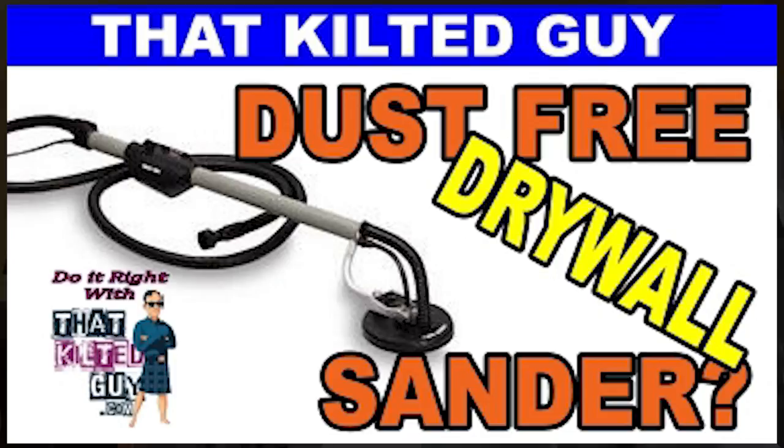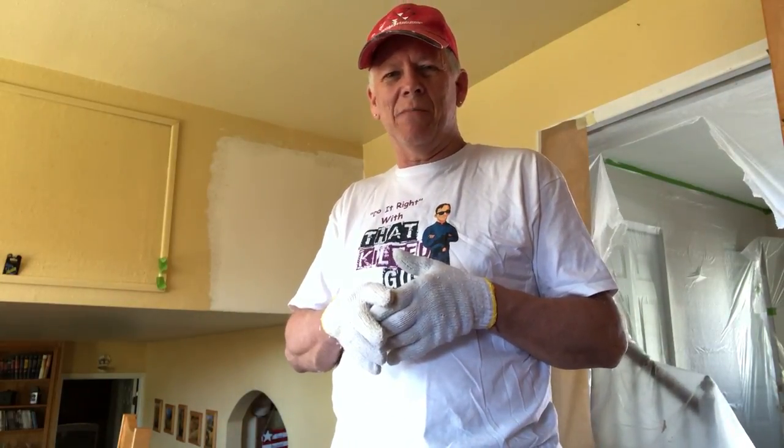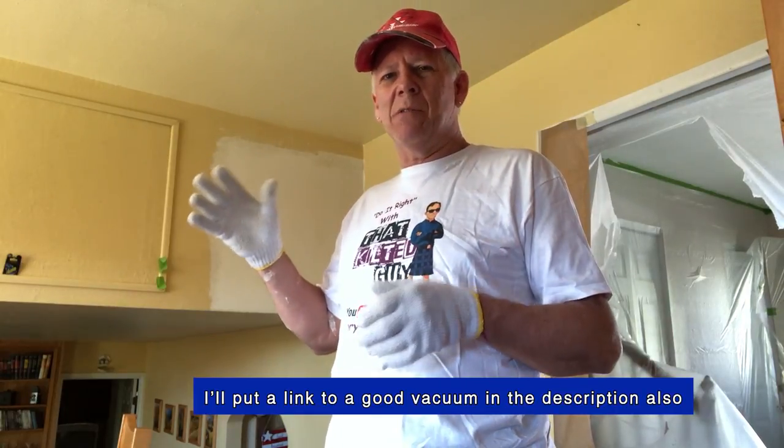I've got this crack all coated with mud and it's dried overnight. You can see it now — it needs some sanding to take off the lap marks and just a general smoothing out. There shouldn't be too much sanding. Now I'm going to use a power sander — I'll show you a little picture of it here; I've got a video reviewing it. This thing will cut down your dust tremendously, so I'll put links in the description if you want to pick up one of those. There are some cheaper versions out now than the one I'm using. The main thing is make sure you have a good quality vacuum that's rated for drywall — if you get too small a one, these things will overpower them and just clog them up constantly. I have a $500 vacuum for that reason, but you can get by with a good shop vac with a drywall-rated filter on it. Now we're just going to sand the middle for now, then we're going to hit the edges with a sanding sponge, and then this thing is ready to texture.